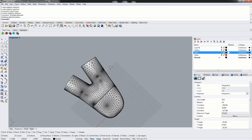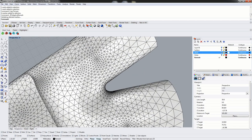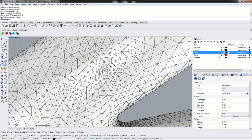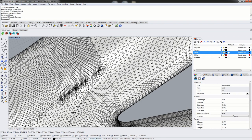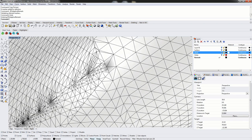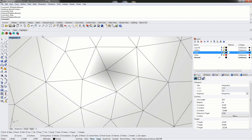The remesher is analyzing the mesh and now giving us estimates and creating the mesh. We've got more triangles, and it's preserving curvature a lot better, especially where the two intakes meet. This is a good result so we'll click OK. Rotating around to examine quality, we'll notice areas where we tend to have zoning of the triangles — they get very small in spots. These can be fixed or left as-is.